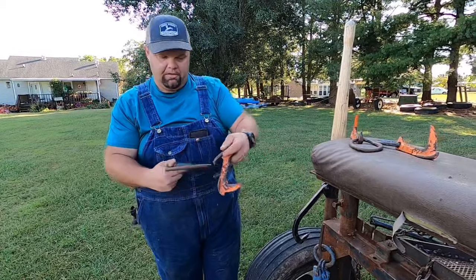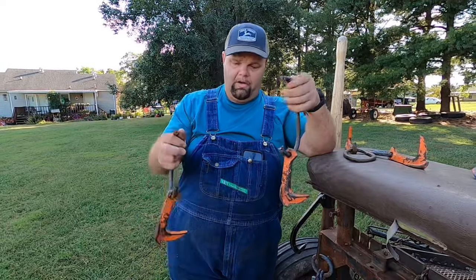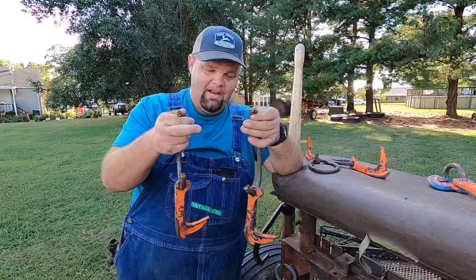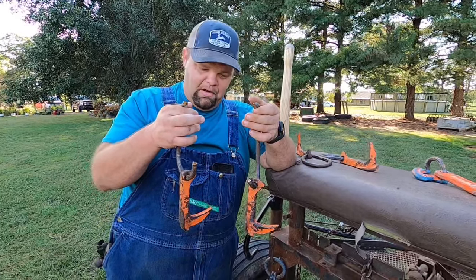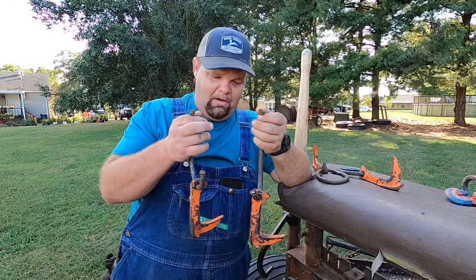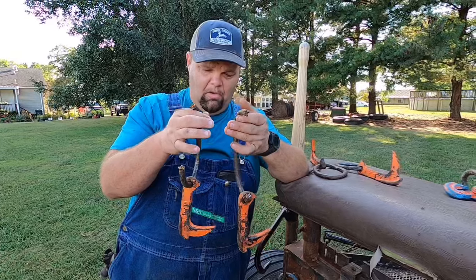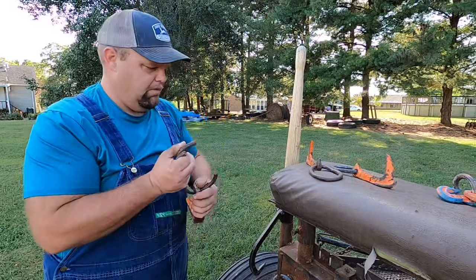Here's the remnants of yesterday. And we didn't get no footage yesterday because I wanted to do this log cart deal. But my mules are getting stronger, y'all, or my welds are getting weaker. It could be a little bit of a combination of the two. Or it could just be that I ain't a good welder. But anyway, these are half inch cold roll rings and they're broke. So we'll have to do a little heating and beating and get them fixed. But that ain't no big deal.